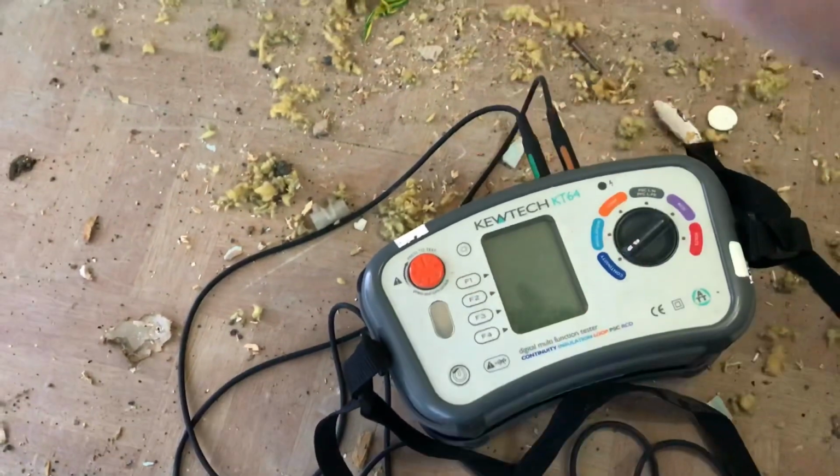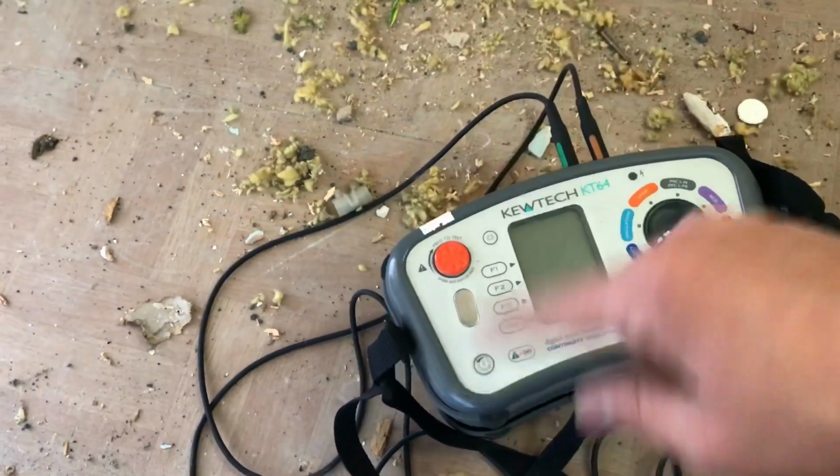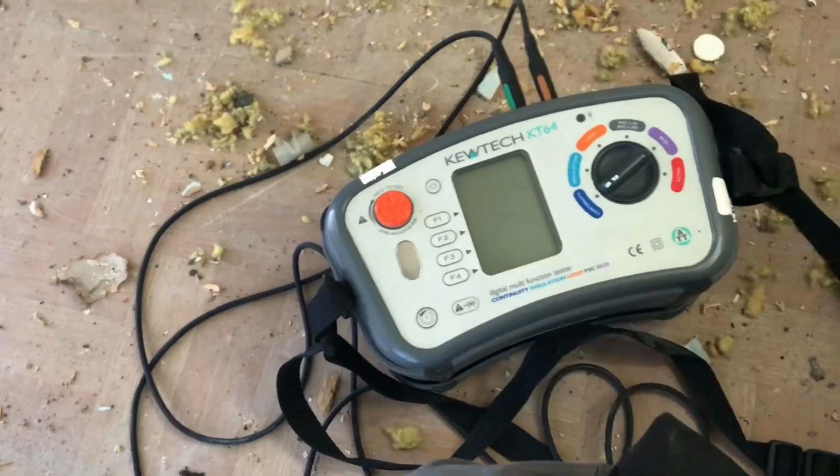Reading in ohms between the, basically, you've got a loop, an earth loop path, and it's good. And then if you want to do the neutral as well, check in your RN, okay? I'll bring you with me, we'll do a little bit of testing in this video.